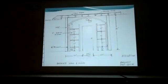This is an elevation of the root cellar of mine. You'll notice that this is a basement root cellar because these are my ceiling joists in the basement. Then I made an arched ceiling. All this is insulated with about R33 insulation. Then I have a pipe coming from outside. From this point up, it's exposed outside. It's the concrete block. So I have the ventilation coming in, down, and out the bottom, comes to this wall, circulates, and the vent goes out the top. It releases all the gases.